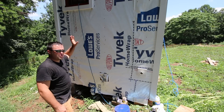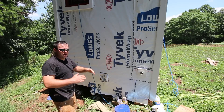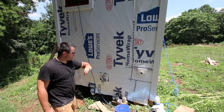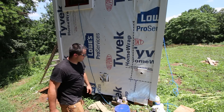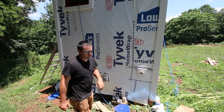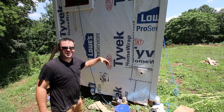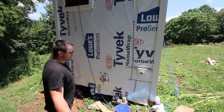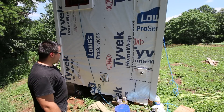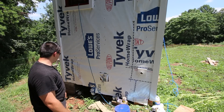I've got plenty more of those blocks to do, but I'm just going to repeat the same process. If I need one wider, I'll do three boards together. I'm going to do the drip cap like that — it's just going to give it a real nice, clean finish once the siding goes on. This will be the first side that gets the siding, so I can mount my bracket that holds my mini split and get some AC inside so when I start working inside it'll be comfortable.